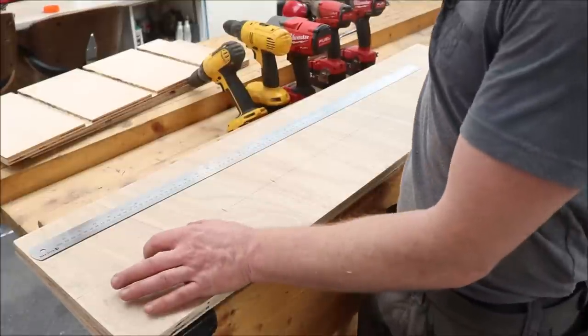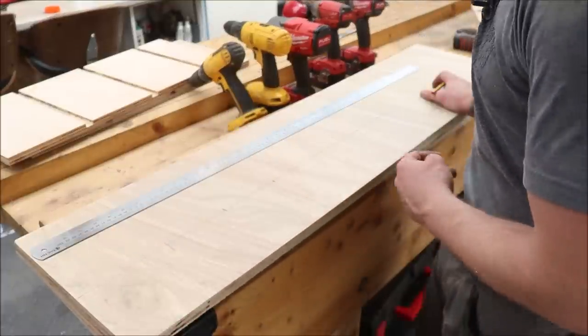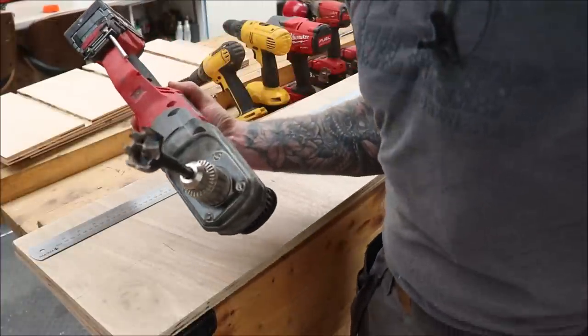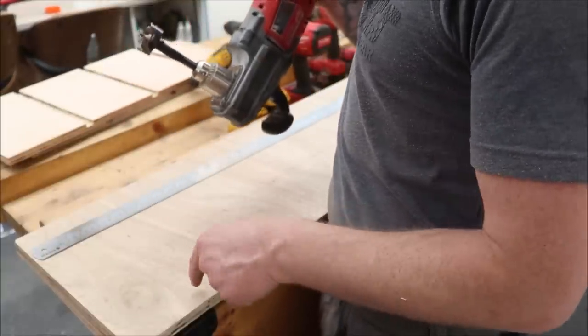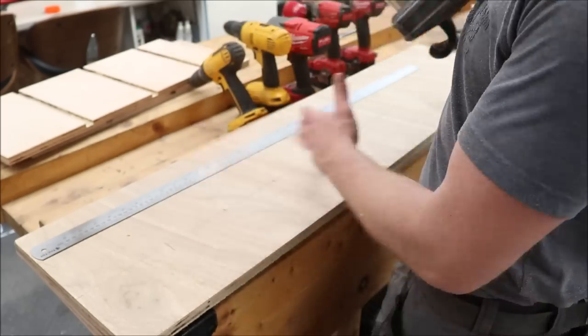Now I'm going to cut my channel at 44mm. That will allow my drill to sit in and enough room to catch my drill. And the reason why I'm doing it at 44mm is because that's the size hole saw I have handy, this bit here, this self-feed bit by Milwaukee. I'm going to drill that straight through at the center point, and that'll give me a nice rounded end on my channel for my drills.